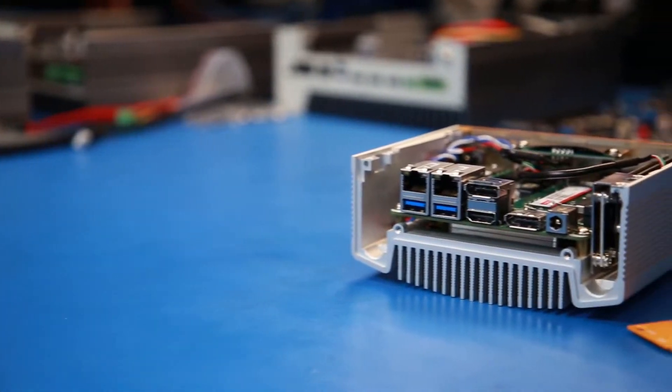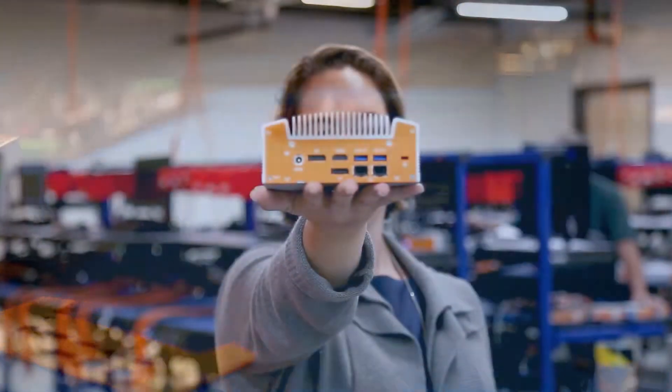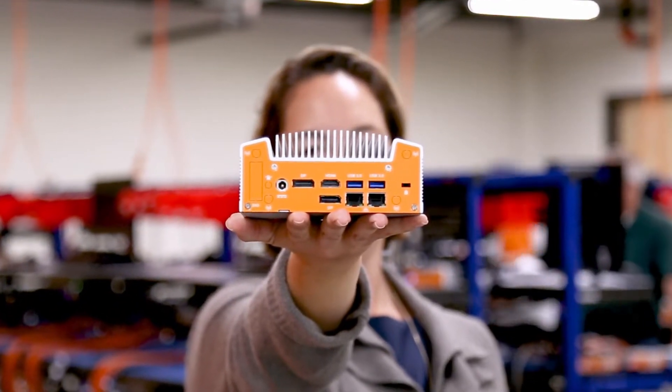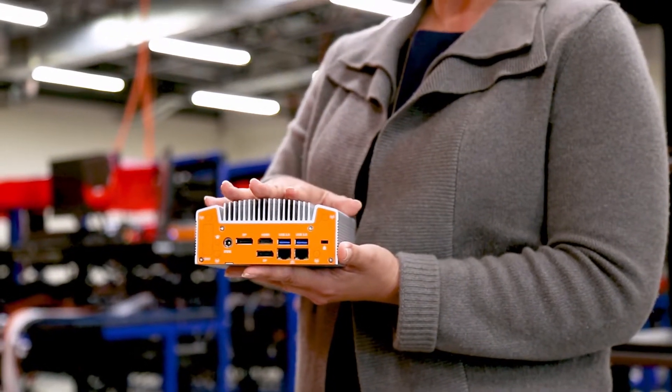The ML-100 G-51 is a consumer life cycle which Intel will support for around three years and comes at a lower price point. If you're looking a little bit more long-term, the 52 would be a great option. The 52 will be an embedded life cycle which we expect to be supported for between three and five years.